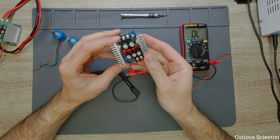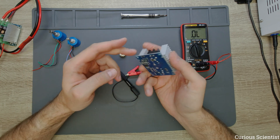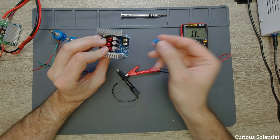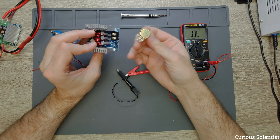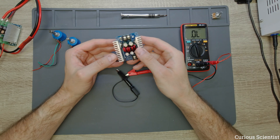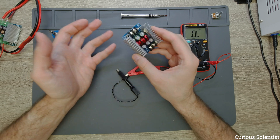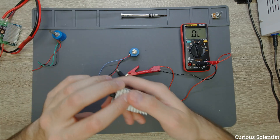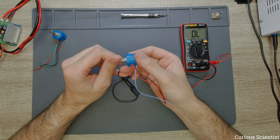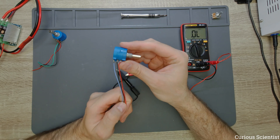I have some other boards from earlier experiments — unsuccessful ones. So here you can just follow the same polarity that you have for these tiny blue potentiometers and use some cables to connect your potentiometer. In fact I use this kind of strategy for various projects — for example power supplies, adjustable power sources — and it worked. But then we have this blue multi-turn potentiometer and it might show some different behavior. I guess those people who had problems with their circuits messed up the wiring because this doesn't have the same wiring.